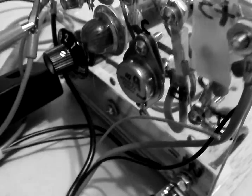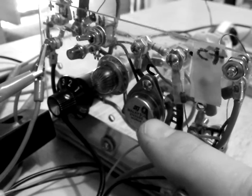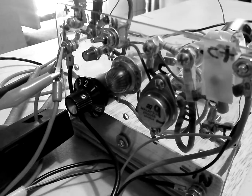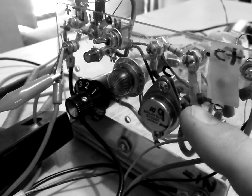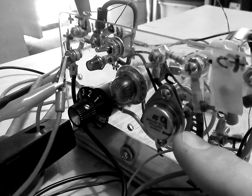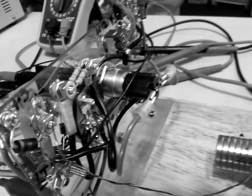That's the circuit. Now we found out from some tests from other circuits we built with the schoolgirl that if you take this, this is a TO3. It's a 2N3055. It's one of the transistors John Bedini used to use. This is bolted right to a polycarbonate sheet, 90 thousandths thick. There is no mica washer here. It's just bolted right to the polycarbonate. We also have the socket there, the TO3 socket. We'll put those on the YouTube list of it.